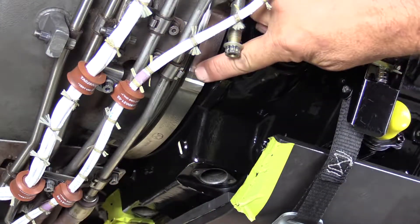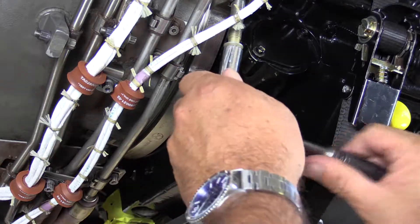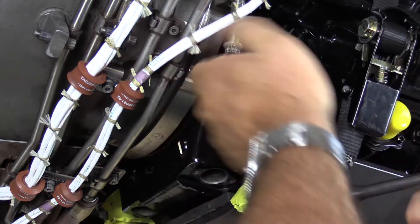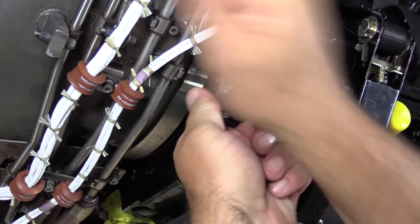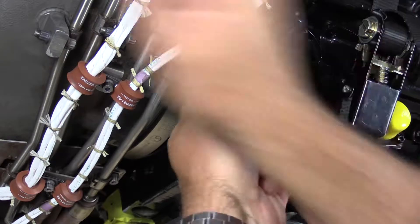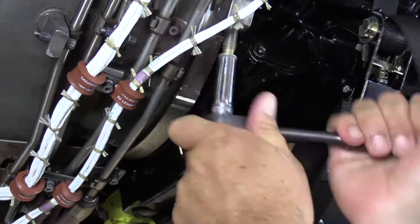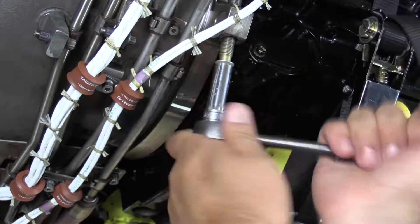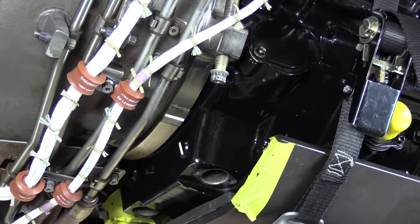Lock it into position. Now we're ready to release the quad ring itself. You'll notice the quad ring has a white index mark right here, and the case of the IDG also has a white index mark down here. As we loosen the quad bolt, it'll go a little bit by hand until it re-engages. You'll notice the quad ring is rotating. Eventually those two white index marks will align, showing that the quad ring has released. When the quad ring releases, you'll know it — it will actually make a sound, and you'll probably see the IDG jump just a little bit.